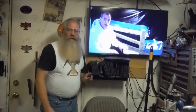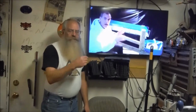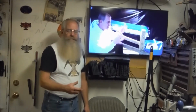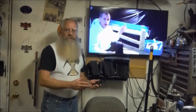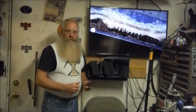Gold hog matting is always something that you're going to refine for your particular area and play with in your particular area to find out what's going to capture the best for your water flow, for your pitch angle, for your width of your sluice boxes. There's all kinds of things that go into getting the best possible capture rate using gold hog mats in your particular area.